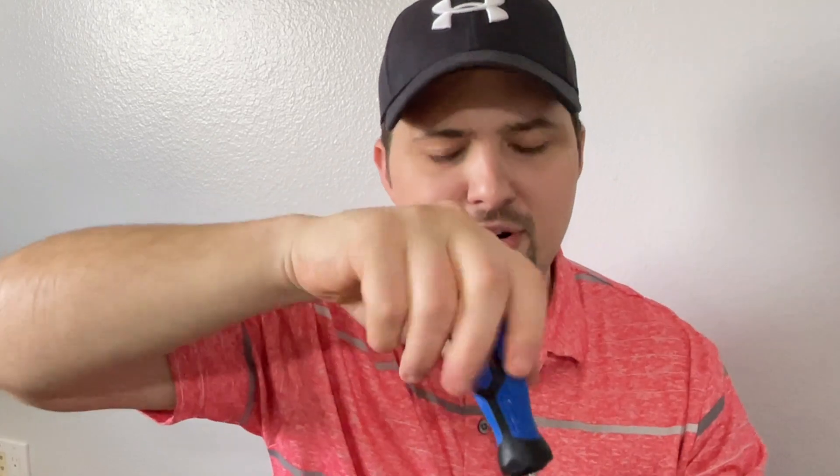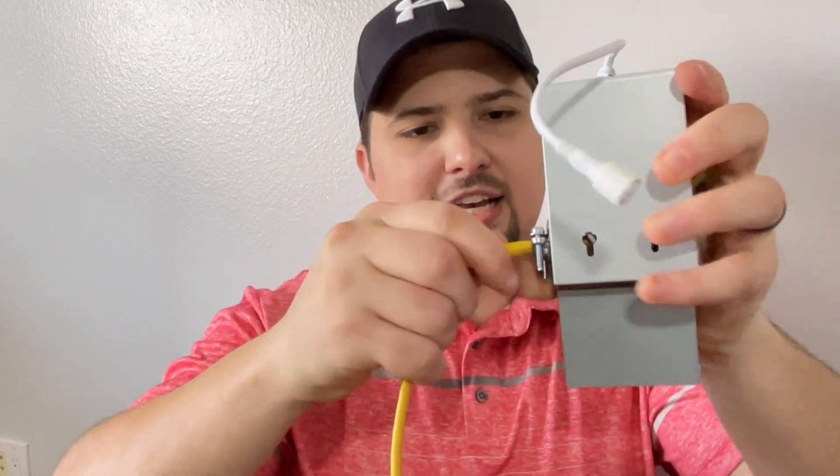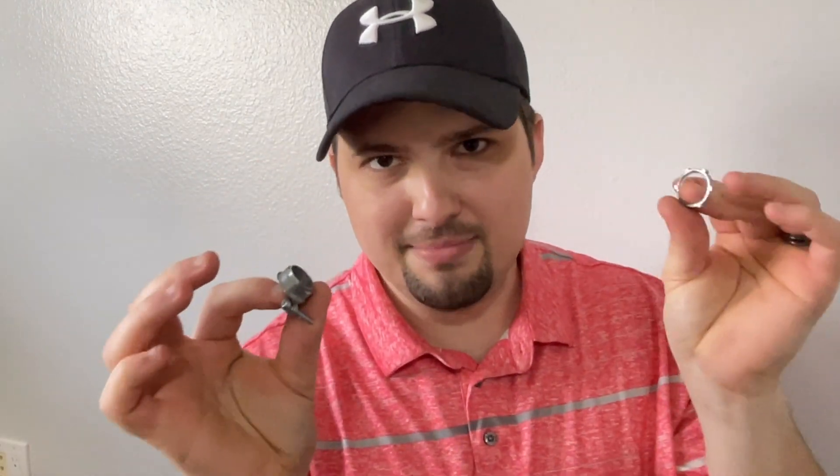The wire might have pulled out before with just a bare knockout — if you had an earthquake, who knows. The metal connector is in there good, and pulling it out took real effort. If you need to go back and fix a mistake, no infinity gauntlet required — just thread the nut off. That's all it takes.